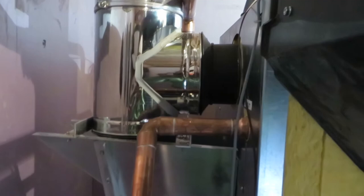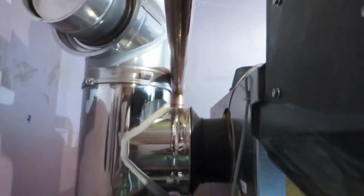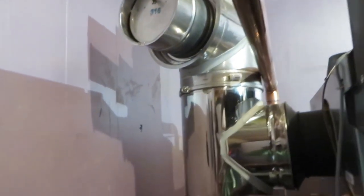It is recommended to have at least 16 feet of chimney on this boiler. That is not specified in the owner's manual — that is based on personal experience. So again, something that should be noted.